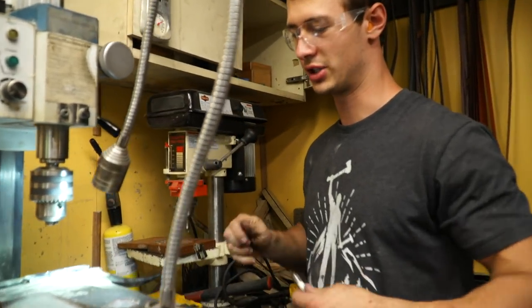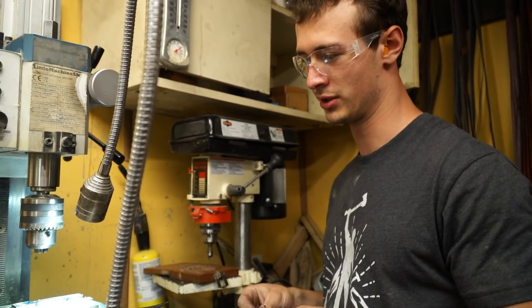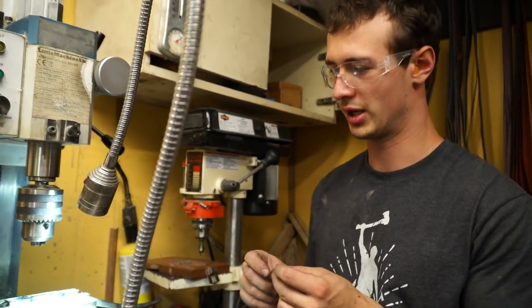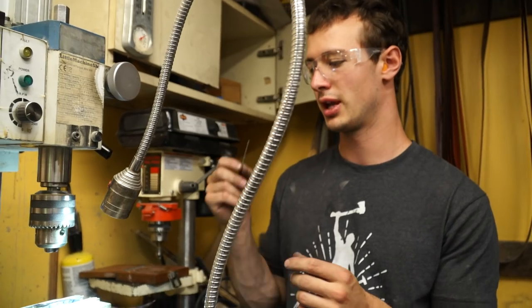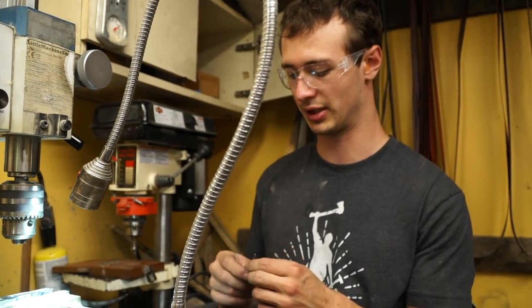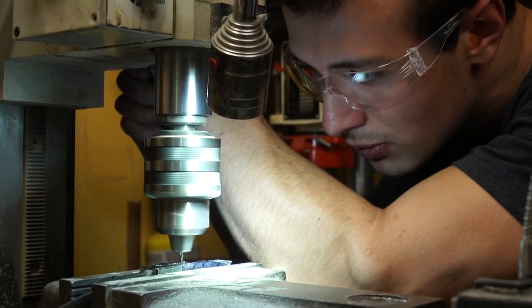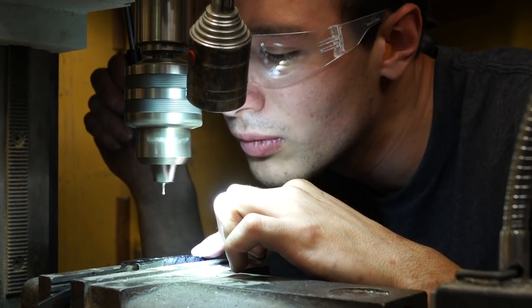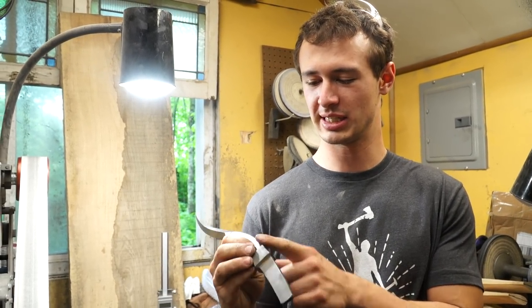After I took it out of the vise, I looked at it and decided that it would look better if it had 4 holes. So, because I hate myself, I'm going to drill a 4th hole. I went ahead and drilled that 1/8 inch hole to a number 29 hole, so slightly bigger. And I'm gonna drill the 4th hole at 3/32, which is like 93 thousandths, I think. Let's go ahead and do that. Okay, so I've got that 4th hole drilled in the spine here.